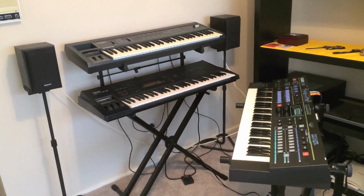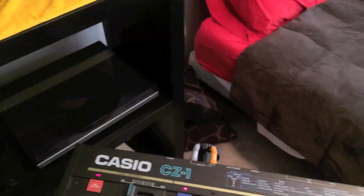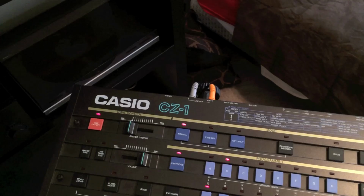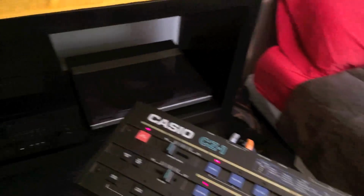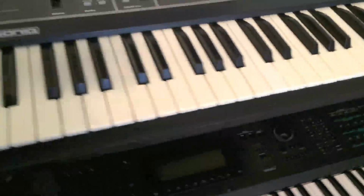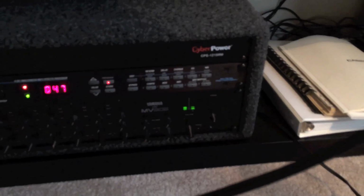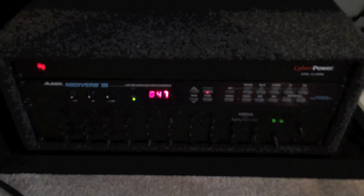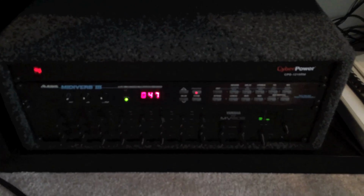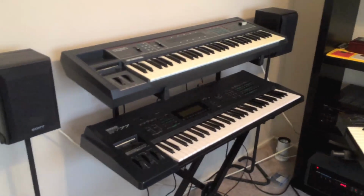So I think that might have done it, and like I said, the DeoxIT has kind of a delayed effect sometimes. So that little crackle I heard, I mean, that was also at about max volume when I heard that. So there might be other factors. You can see it's clipping. So this is definitely, I'm definitely on the right track at least.